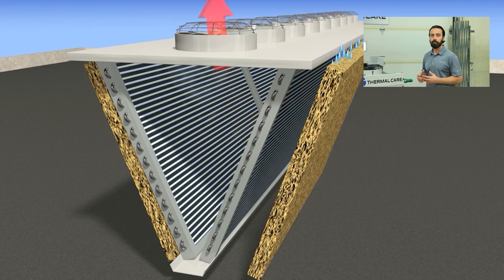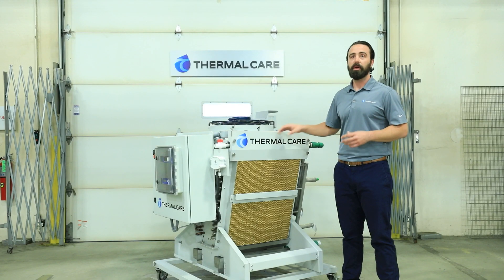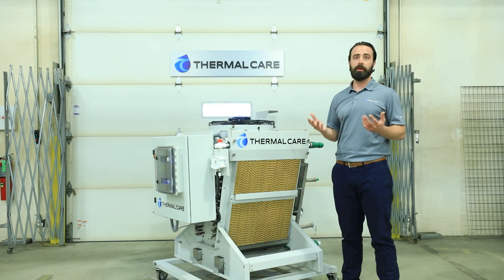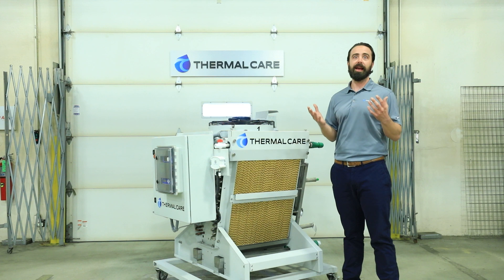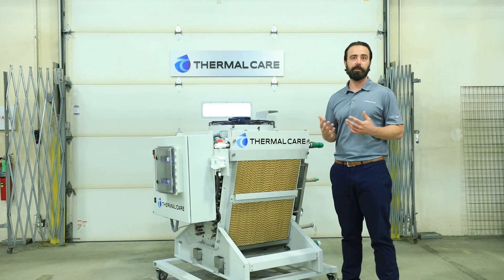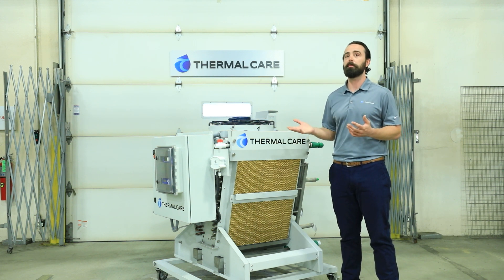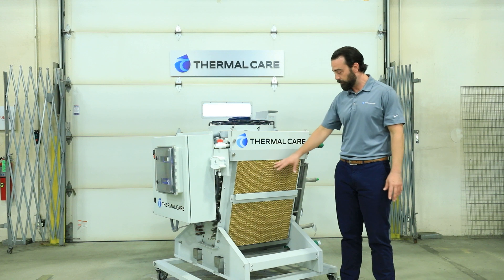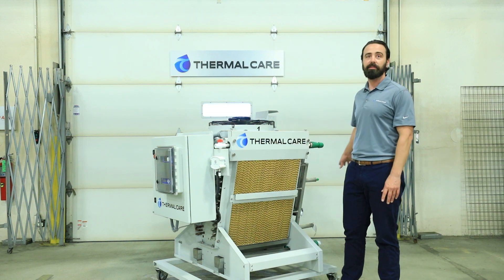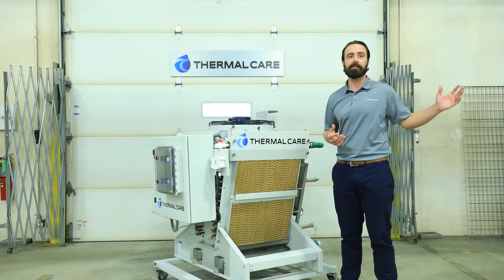Another means of attempting to do this is spraying the water directly on the coil of the fluid cooler itself. But when water evaporates, only the water leaves. So any dissolved solids can be left behind and that can eventually build up on the coil itself, essentially acting as an insulator which would inhibit your heat transfer and be a detriment to the system. You also have the possibility of corrosion when you're spraying water directly on metal. When these units are completely soaked with this pad, it's contained and runs down into a trough that can then be managed — whether it goes to drain or even used for other requirements within your facility, such as a wash down.